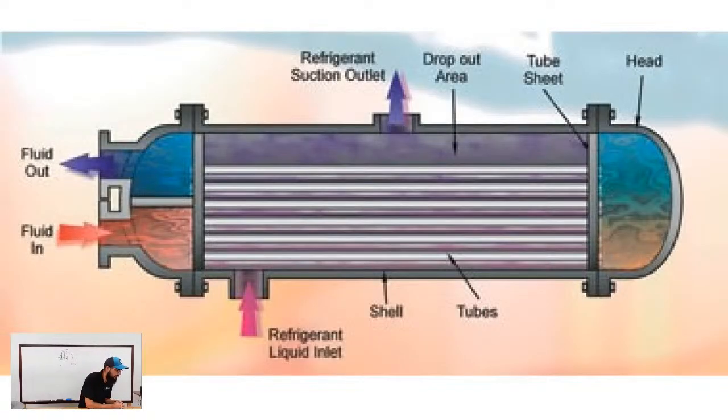Let's see, do those hybrids still have a liquid level sensor? Yes. Now, York, for example, they don't put a liquid level sensor on the evaporator. The liquid level sensor goes in the condenser, but Trane will use a liquid level sensor on the evaporator. They're very common to do that. So you'll see that with a Trane system. There's several series out there that I could think of that use that on the evaporator, but York is using it on the condenser side. And this is just kind of another example of how we're exchanging heat.